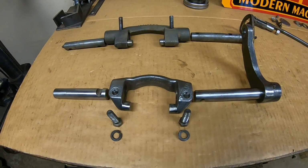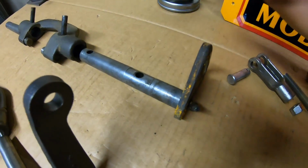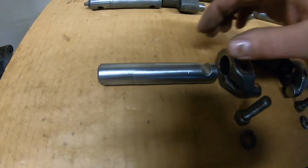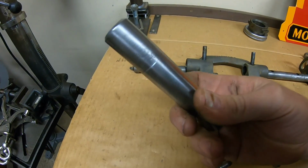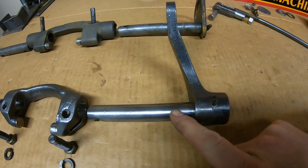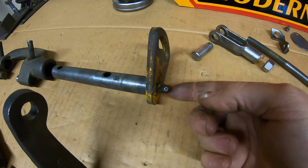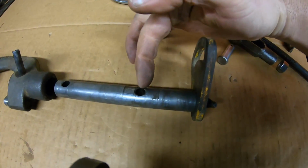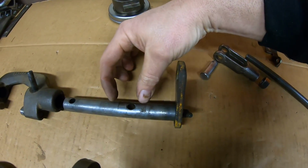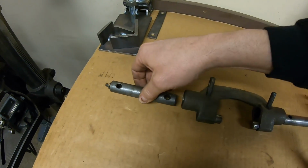We've got better coming. And once again, on the lubrication front, you can tell we've got a lot more thought that's been put into helping these production shafts to last than what we have on the prototype. The prototype has no provisions for adding grease, but honestly, you can see a little bit of a step there, but they're really not worn that bad, all things considered. So the production ones, they drilled for grease zerks at the end of each shaft, and then that's a grease passage that comes into this drilling, and that drilling is located, as you can see from the witness mark from the wear, right in the case bore on each one. So that helps to keep a lot of lubrication on those pivoting points.